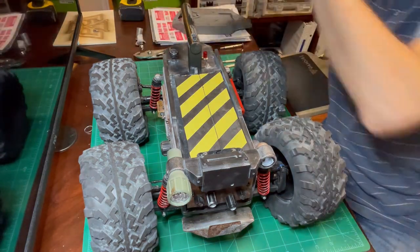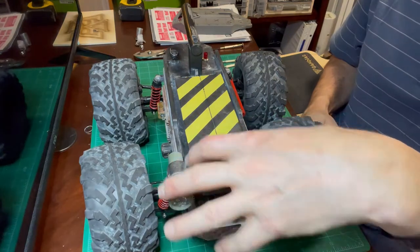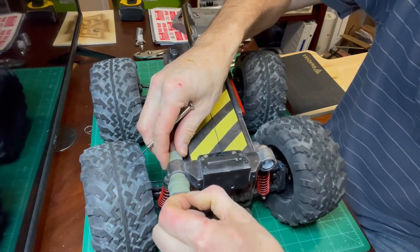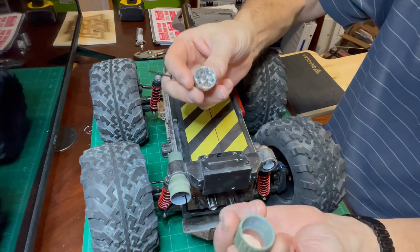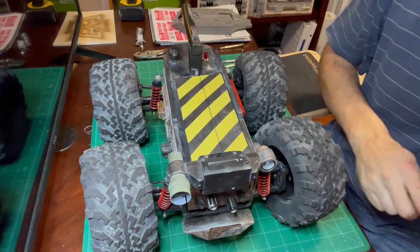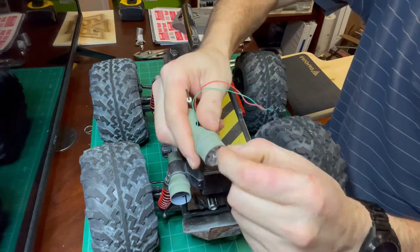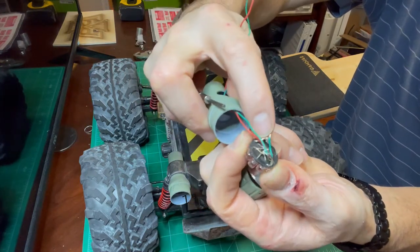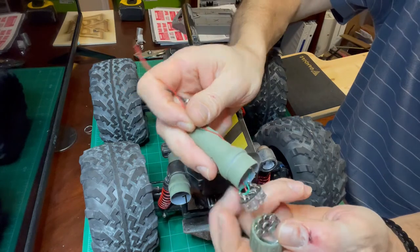I'm going to move over to the back end. I'm not going to take off the back end and probably not going to take this flashlight off either, because the whole front assembly will come off and we'll be able to put it on the other one easily. I will take this apart to show you the inside. This flashlight is a 9 LED flashlight. Again, the lens from it fits in here quite nicely. Solder the center pins, solder the outside pins. The positive is in the center and the negative is on the outside, and it does run on 5 volts quite nicely — it's very bright.